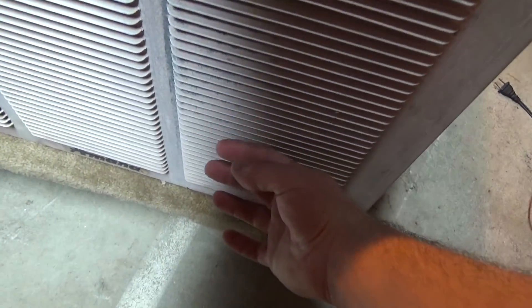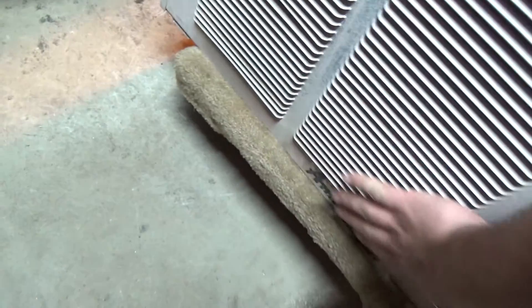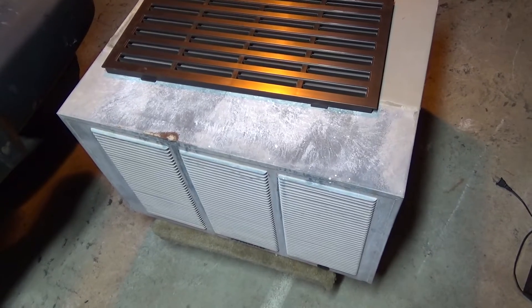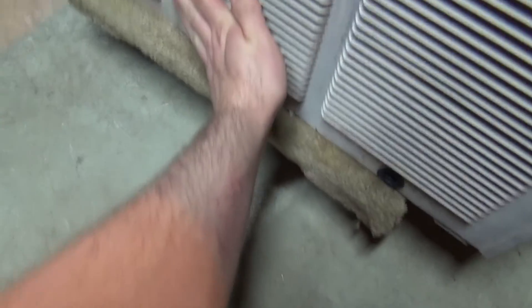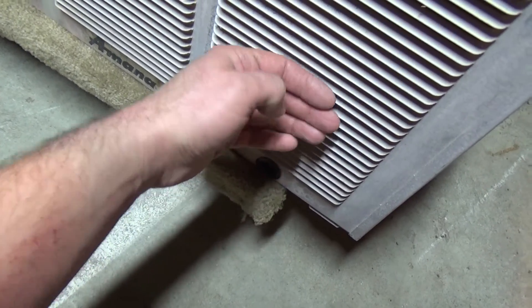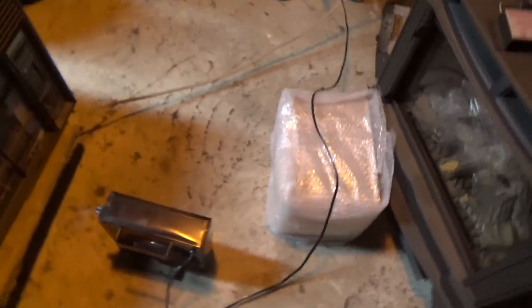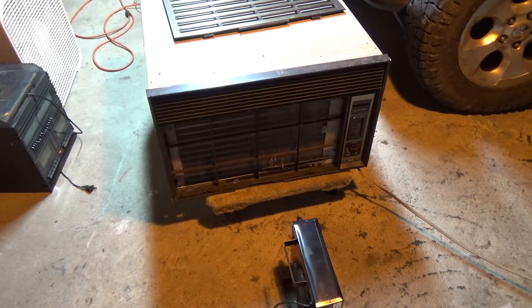Although I don't know how much I'll be able to put in because the condenser is shot on this. There's airflow and no airflow — like a quarter or a third of the condenser is just rotted. The problem is the head pressures are going to go crazy if I start adding more gas. There's really nothing here — nothing at all — it doesn't start until almost halfway up. I'll try to clean it some more but I don't think it's dirty, I think it's just rotted, and that's only going to get worse.